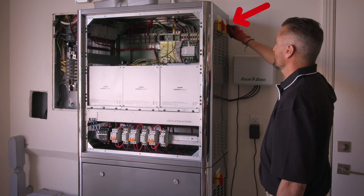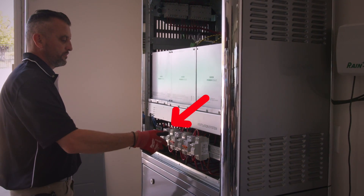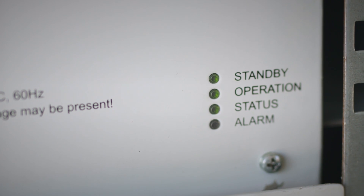After this, turn on the main inverter switch that allows output from all inverters to the sub panel. Then turn on the grid input. Turn on all other breakers for power out to loads first, then turn on the remaining DC breakers that energize the inverters and PV. The entire process to start the system up should take around 40 seconds.